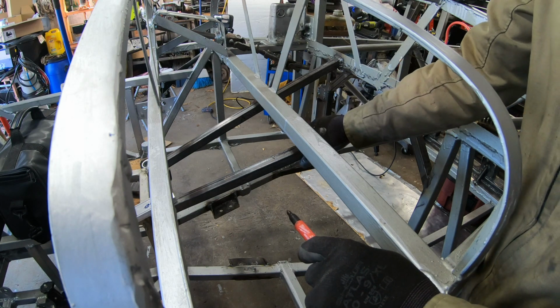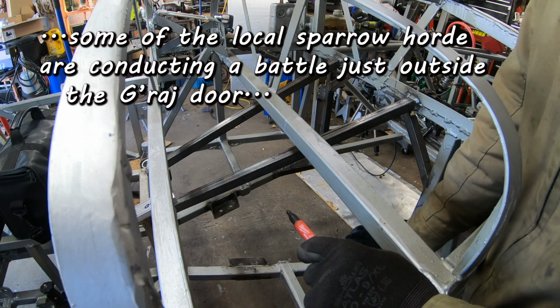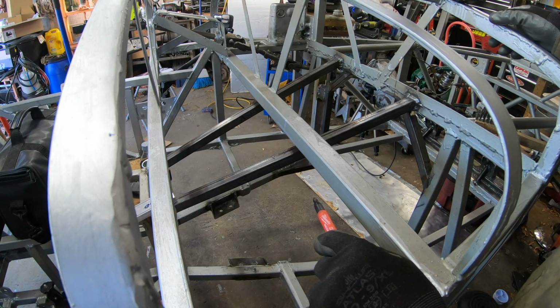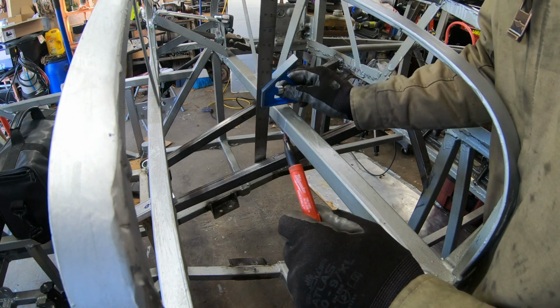And that will brace the tubes to the floor and brace them side to side. And that whole thing, this whole business here, the transmission tunnel tubes and the drive shaft tunnel tubes coming out to the firewall, helps to stiffen the chassis through the middle. It adds some torsional rigidity to this whole area. I got to make a couple of marks on the tubes,